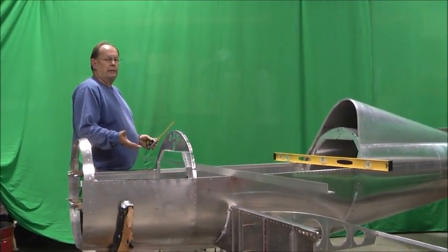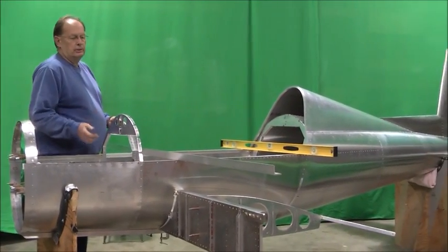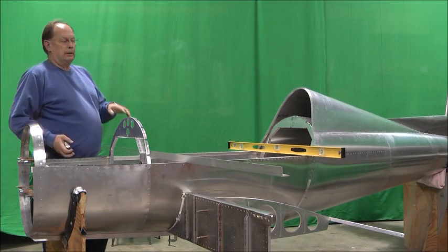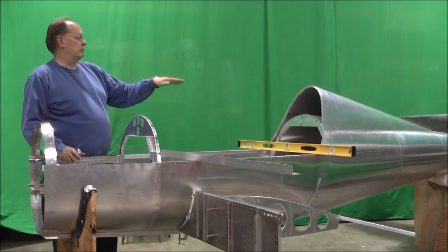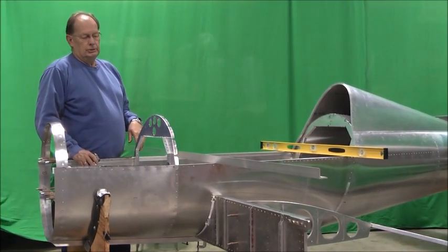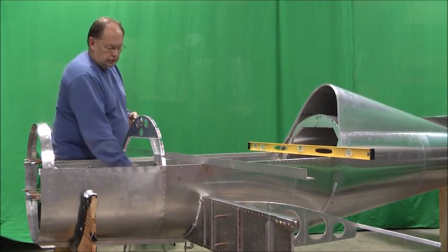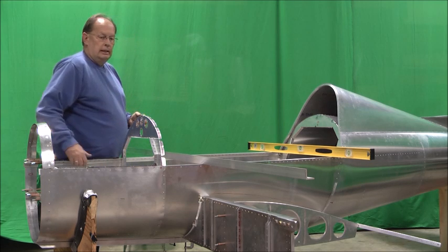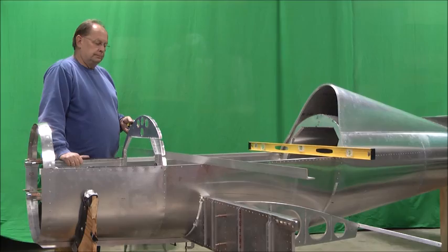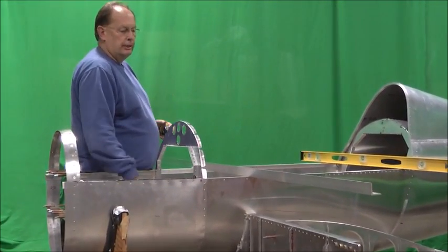And again, it's not going to affect how the airplane flies, but if you have any home builders at your field walk by your airplane, everybody walks 15 feet out in front of the airplane and eyeballs across the center section of the wing to the horizontal to see if you're a good builder or not. So it's important to try to get that perfect. The way you'd adjust that, of course, is just shimming, putting washers underneath the bottom spar cap to the bottom rails before you bolt things down.